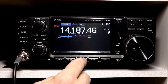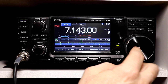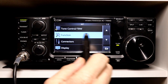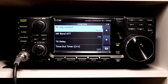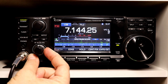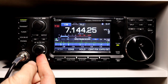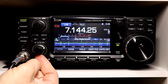Let's try to find some place where I might have some signals — I don't even have this antenna adjusted for anything. But you can see a bunch of signals here, and as I turn this down, no change in the gain. So let's go to the automatic mode. In automatic mode, it operates as RF gain only, no squelch, when you are in sideband or CW or any of those modes. If I turn the gain down, you can see the evidence of the gain going down. And if I turn it all the way to the right, nothing happens. So it's RF gain only when I'm in sideband.